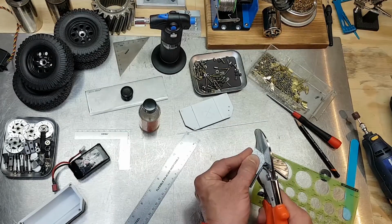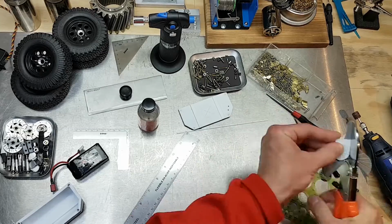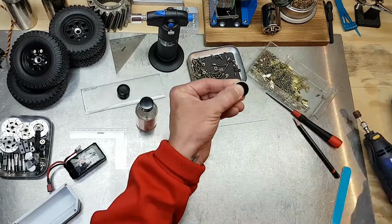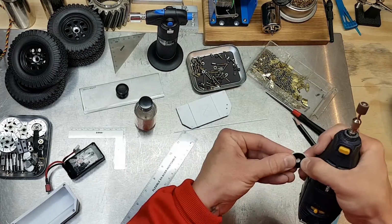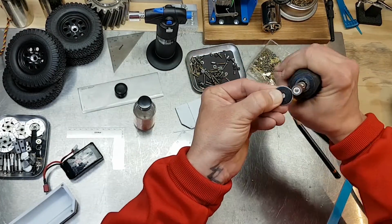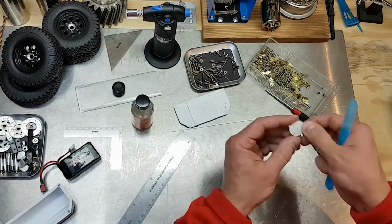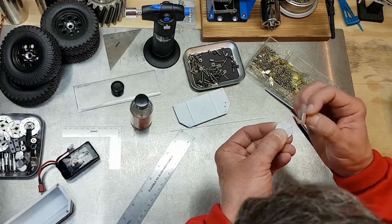And you'll see after I trim off the excess with my styrene shears, I'll use the washer in combination with the rotary tool and almost use it like a router. This makes sure I don't trim off too much or have any misshapen circles. And with a little cleanup using a nail file, I end up with a pretty clean product after.